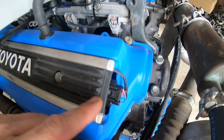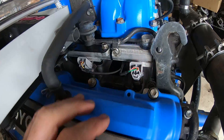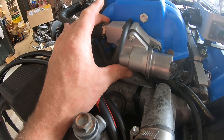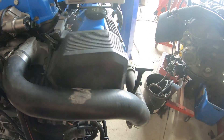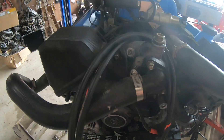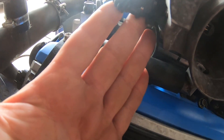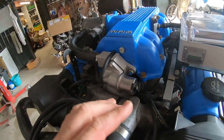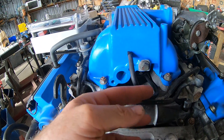We have a plug poking up for the coil-on-plug wires, with wires coming out to the injectors along the inside of the fuel rails. There's the aftermarket two-wire idle speed control, the wires for the coils going through the front holes. I've put some battery cable on so that can be inserted appropriately, up to the TPS and air temp tucked in the throttle body. Most of the action is happening under the middle. I even managed to run the vacuum line in discreetly.